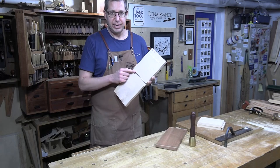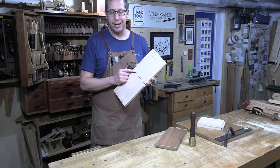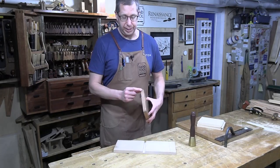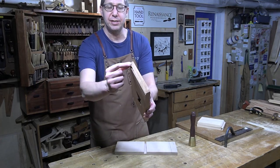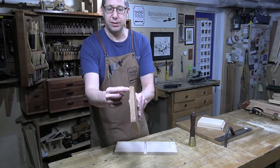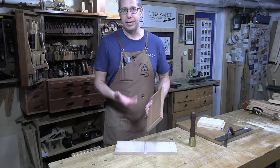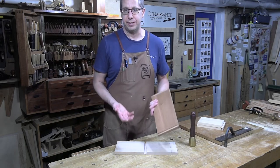Making that bottom edge nice and square stacks the cards in your favor. The wedge and dovetailed action of the top and tapered action still acts exactly the same way, and it's a little bit less work. This tapers in both directions — I rely upon a center line, and you can see I've still got a center line all the way down the middle on both edges. What I'm going to show you today is really the more standard approach: when I use this in a piece of furniture, I generally only taper that one side. It's just a lot less work with really the same strength and result.